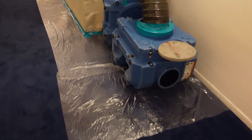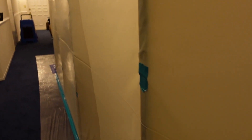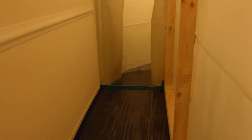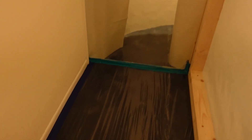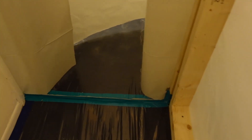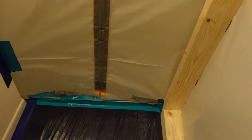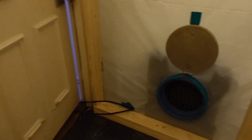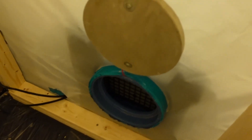This is the other side of our containment barrier, but now let's go on the inside. We are going to open her up — double zipper entry, because that's how we roll. Inside, we're going to have area one of our three-part containment barrier. We've got a flat entry door which is going to take us into the air conditioning closet where the HVAC servicemen can go ahead and disconnect that unit. And then we've got yet another deluxe product: our ReuZip magnetic zipper. This we're just going to push our way through, and there we've got our intake to the machinery.